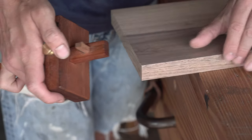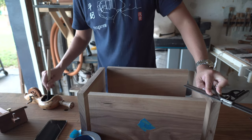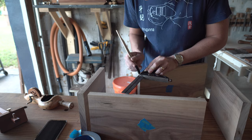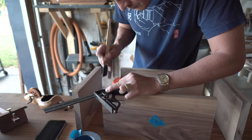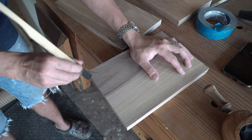I was under the impression that the miter was completely separate and apart from the pins and tails, when in fact the joint is a bit more complex. The cutting gauge lines for the baseline can in fact be on all four faces of both tail and pin boards, and after a FaceTime with my buddy Anthony on the subject, I realized I was basically doing it all wrong.